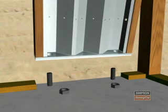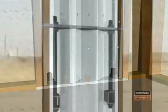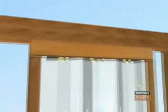Place the whole assembly over the anchor bolts, adjust the wall as necessary, and then secure with heavy hex nuts. If required, attach a shim block in between the steel strong wall and the double top plates with the SDS 1/4 inch by 3.5 inch. Note that the maximum height of the shim block is 8 inches.